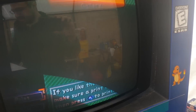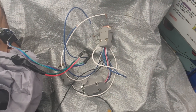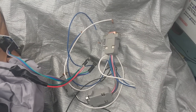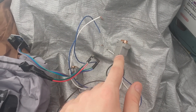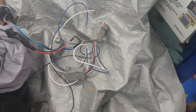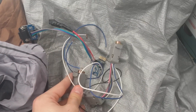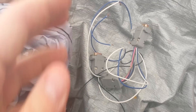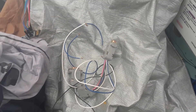In order to get the messages between the Snap Station and the card reader, I had to create this serial spy cable. You connect one end to this RS-232 adapter, the other end to this adapter, and then using a third connector you connect this into your PC — and that allows you to see the messages going back and forth. That was the easy part, but the hard part was determining what the messages were — and I finally got it.